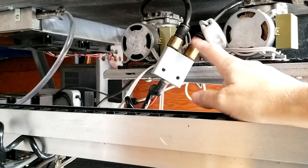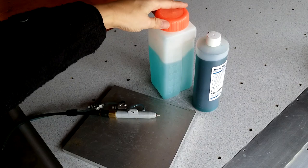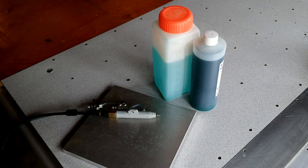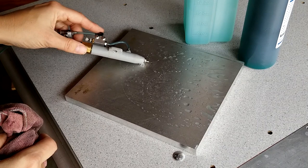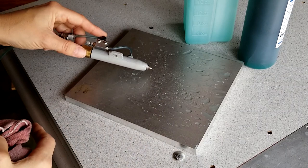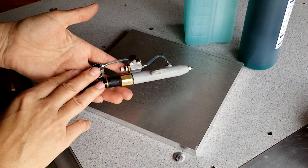Here I have some cooling mist concentrate — this happens to be Cool Mist 77 — mixed up in this container. I tend to make it stronger than the directions say you need to. I'm using this mostly in an open environment, but if you're going to use this in a closed or confined space, you should use some kind of respiration, because it is an aerosol. I don't think it's dangerous like chlorinated oils, but it's not safe like cranberry juice either. With this on, you can see it does put out coolant and a fair amount of air — not as much as I'd like. I use this not only for milling aluminum but also for cutting stainless steel. When I'm done, I shut off the valve and keep the system elevated so it doesn't siphon out.